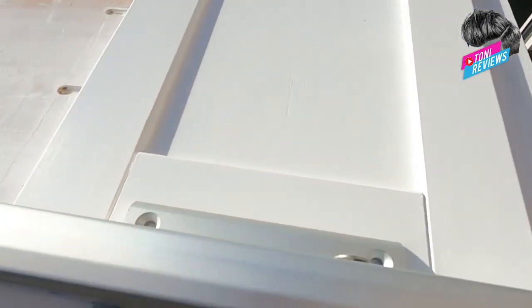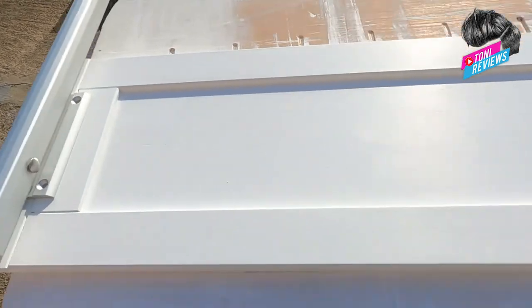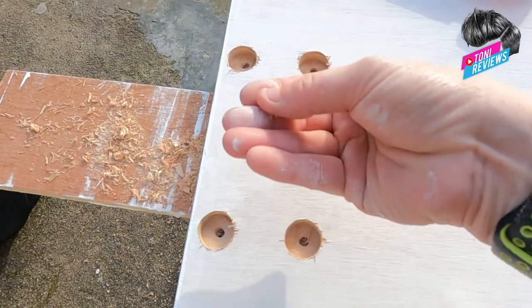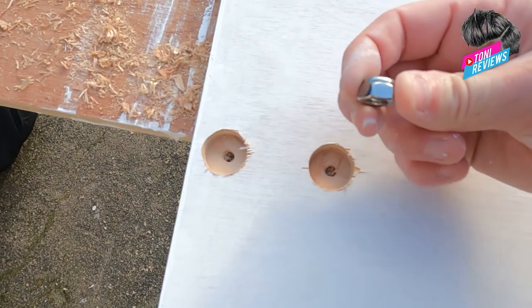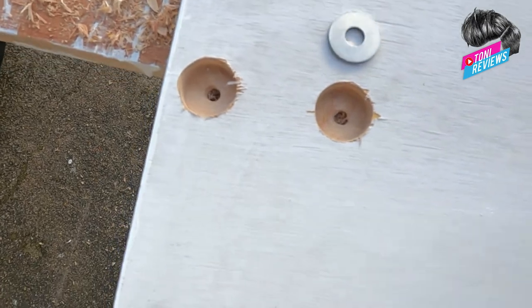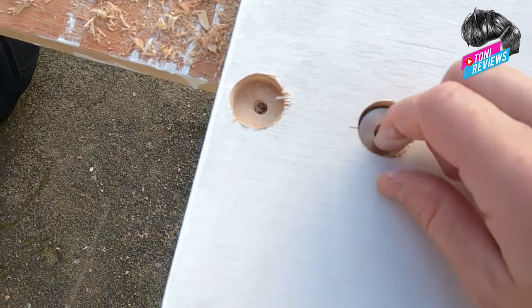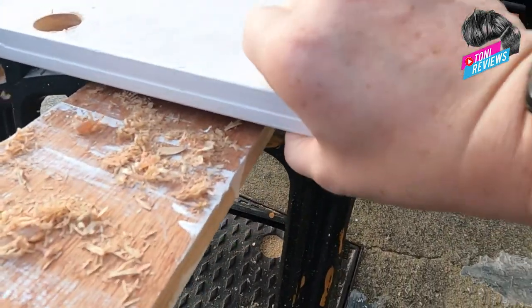So I've doubled up my battens, my shaker style battens, to give enough width to this, and I don't think it actually looks out of place within the whole face front either. Where I've designed my two spectacle frames on the seating to clamp together, part one and two, it means when I put my table on, it's going to sit proud on that side because of the length of the bolts and the washers going on. So I've used my Forstner bits to countersink out the depth of the bolts and the washers. So hopefully there shouldn't be too much of a gap, you know what I mean? It shouldn't be pushing against it too much. That's hard to get out of there now, but basically you've got the depth of that going through anyway, so it should provide enough support.